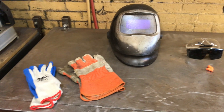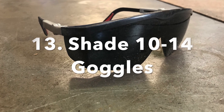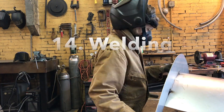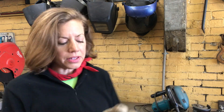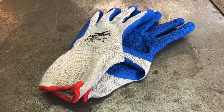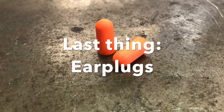Now we're getting to safety equipment. Clear goggles for grinding and sanding — I think these are rated 10 goggles for my plasma torch — and then I have my welding helmet. This is an auto-darkening helmet, which can be expensive, but you can pick up a standard welding helmet for a very small cost. For the longest time I used basic gardening gloves, but I've moved on to rubber gloves. These are not rated for fire or welding, but I've worked long enough to know not to touch hot metal, and for 16-gauge material and fine artwork with a lot of detail, these have been great. I'm around loud noises all the time, so I really want to protect my ears — I would recommend earplugs.